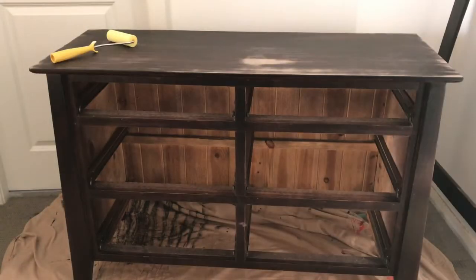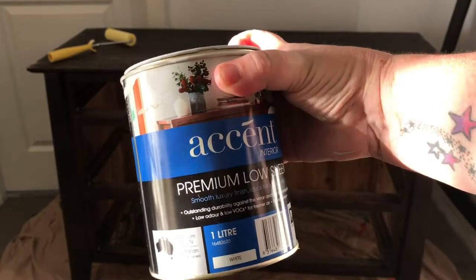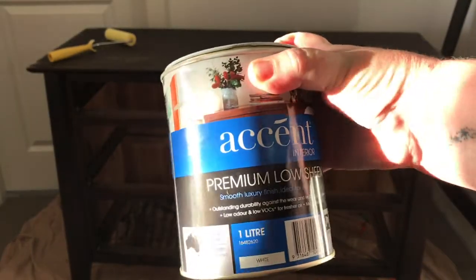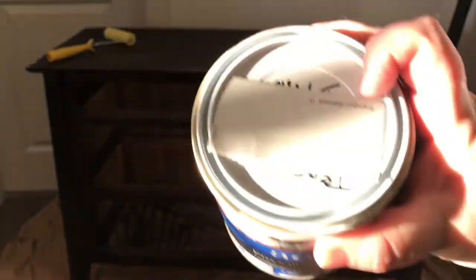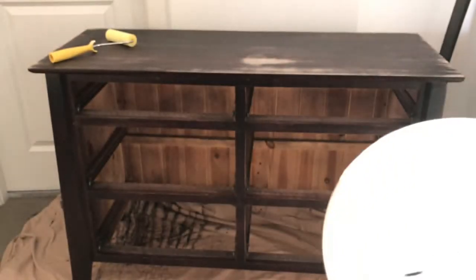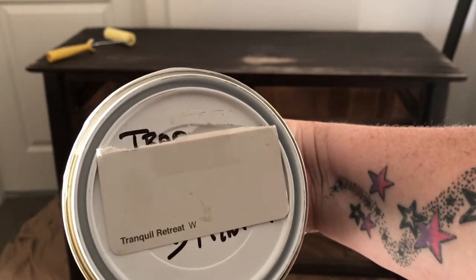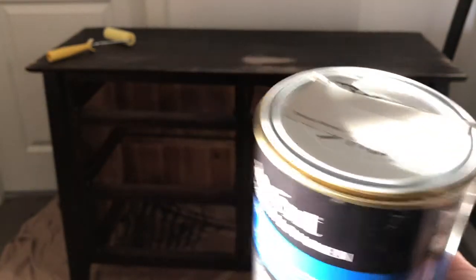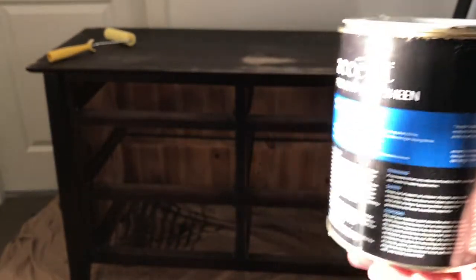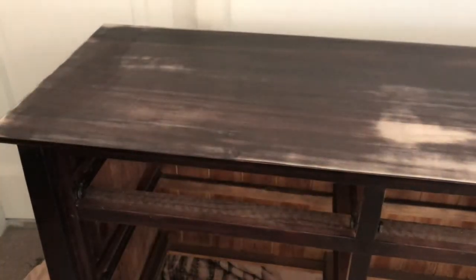So I'm using a chalk paint recipe on this dressing table, as I have done for most of my projects. I'm using accent interior wall paint. The color I'm using for this piece is Tranquil Retreat. It's a very light grey, and I am actually mixing that with some plaster of Paris to create a chalk paint. You can see the recipe for my chalk paint in the bedside tables video, and I can leave a link below in the description box for that one.